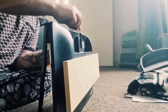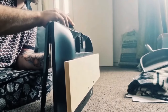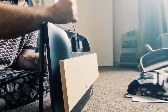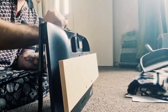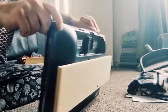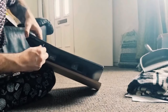So when you're doing this, just make sure the PCB which is attached to the buttons on the bezel doesn't get damaged or disconnected from the wiring, and I'll show you what I mean in a sec about this. And we'll also notice that underneath here are the speakers. So yeah, like I said, it's a very irritating part, but it should look good once it's coming together.